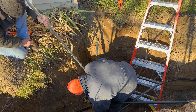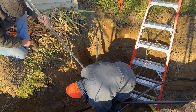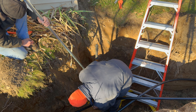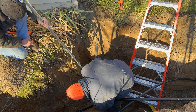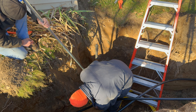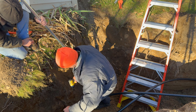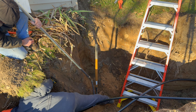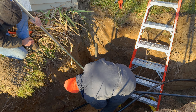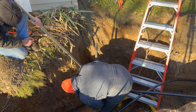For those who have ever installed faucets like this before, a couple of steps coming up that you need to pay attention to. These are frost-free hydrants - which means there's no water in the standpipe. When you shut this off, all the water in the standpipe drains out. In order to drain out, we need to make sure we put some pea gravel down in there so there's room for that water to drain out of the standpipe once you shut it off.